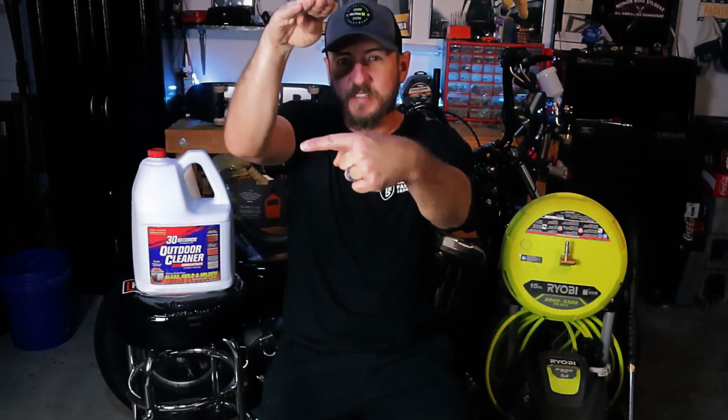So freaking awesome. But one thing I want you guys to keep in mind, when you're pressure washing the fence, make sure that you're using a constant motion up and down. I don't know if you guys have ever painted anything, but you don't want to stop in the middle, because that paint will collect. Same thing with the pressure washer. If you stop in the middle, that thing is cutting. It's gonna cut a little line into wherever you're going. And then if you keep moving on, you're still gonna see that line right there. So just be very careful with that. Just constant up and down, wax on, wax off.